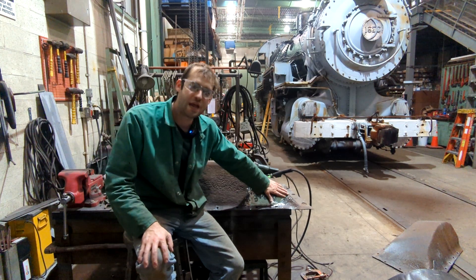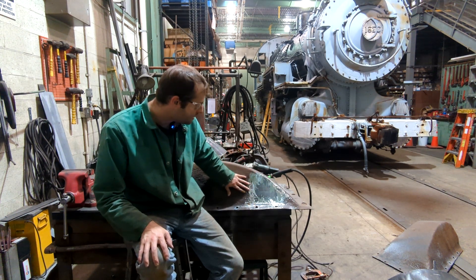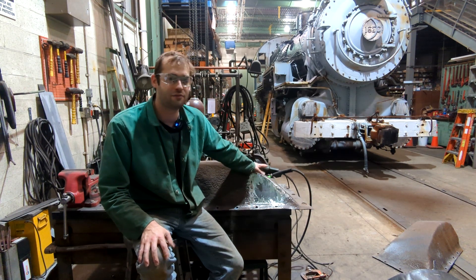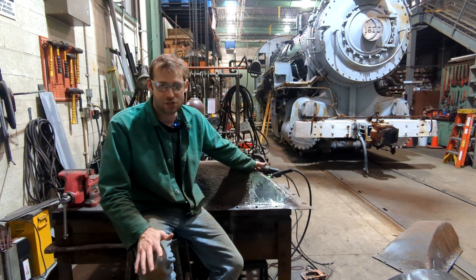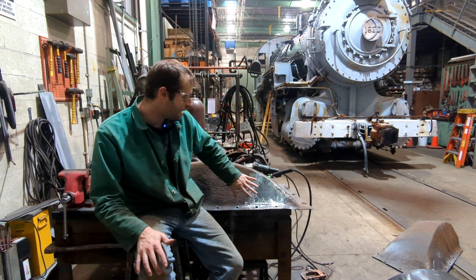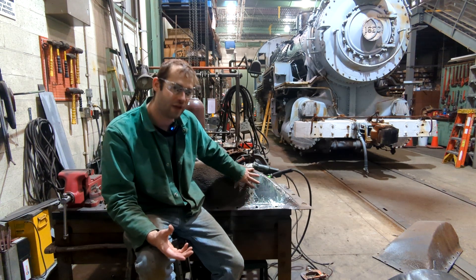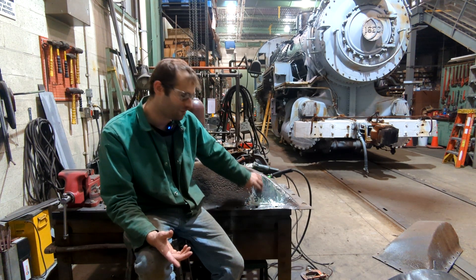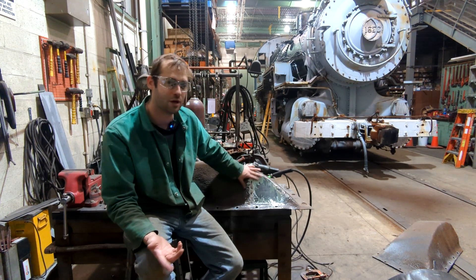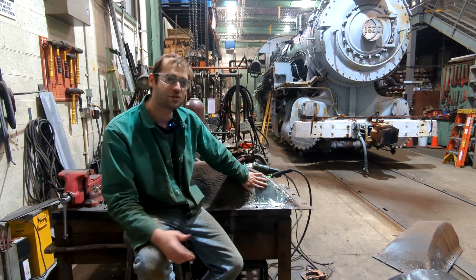I've saved you the trouble of watching me polish this down with a flapper disc. I think it came out really good considering. I'll show you both the inside and the outside as an outro here. The fun thing with doing projects like this is I always get amazed at just how formable metal is — like wood, you can't get away with this, you'd just end up snapping it. It's really fun how I started with a flat piece and ended up with a piece that's rounded with a nice hump in it, even though I didn't actually roll it. I used just the heat from the welder and tacks to hold the metal in place. Overall this came out good — it's going to get painted with a thick paint and it's going to be underneath the locomotive anyway, so you're not going to see any of this. Thanks for watching and have a good one.